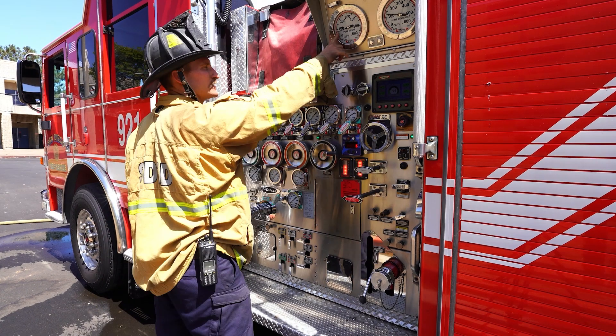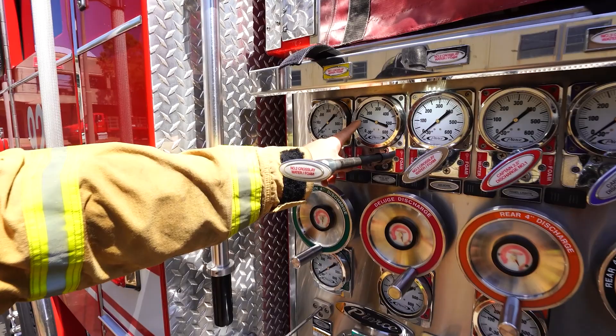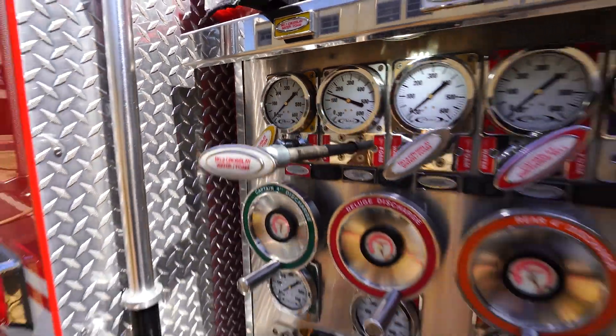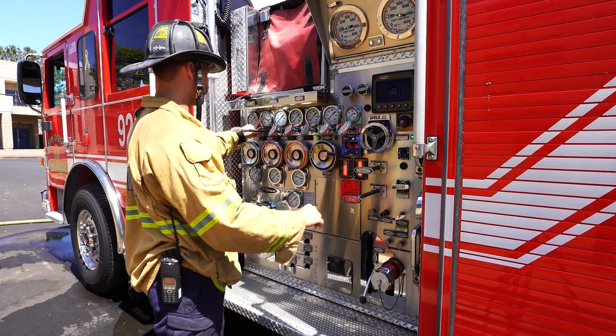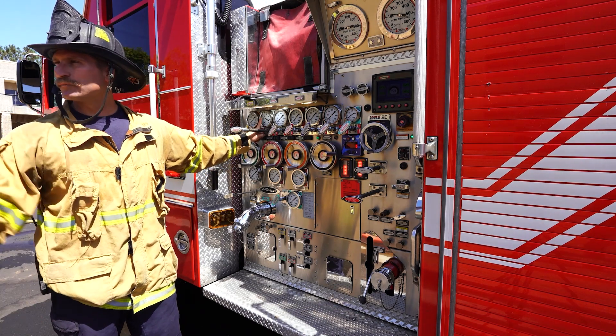Note the intake static pressure on the suction gauge. Available flow from the hydrant cannot be calculated at this time — it can only be calculated with an additional line flowing. Deliver correct pump pressure for the hose lay; pump pressure under or over 15 psi of calculated pressure is unacceptable. Use the discharge gauge for reading due to possible differences between main and discharge gauges. Visually check that the firefighter has water flowing.